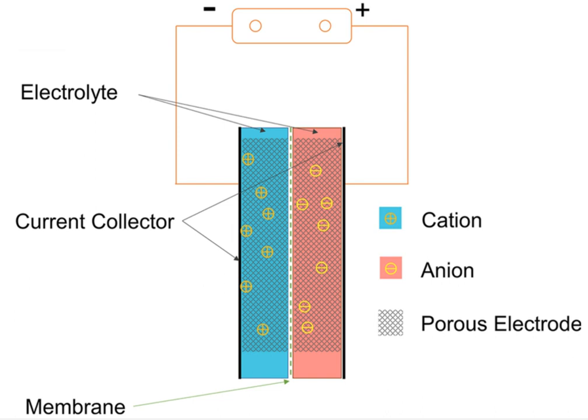Electrodes. Supercapacitor electrodes are generally thin coatings applied and electrically connected to a conductive, metallic current collector. Electrodes must have good conductivity, high temperature stability, long-term chemical stability, inertness, high corrosion resistance and high surface areas per unit volume and mass. Other requirements include environmental friendliness and low cost.